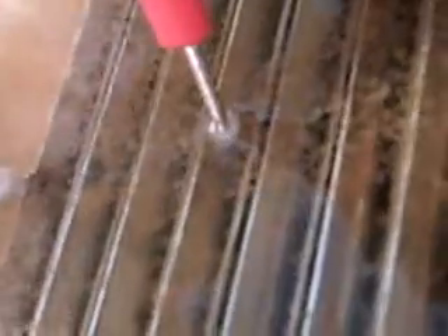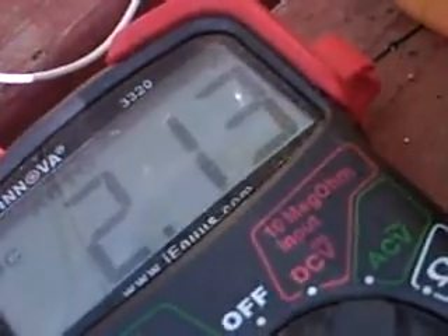Next I'll go to 36 volts. I'll start 3 slots over. Just by sticking the tip of the meter in you can see hydrogen coming off the tip. Starting at 3 slots: hitting 4 to 6 amps. I'll go 6 slots out to show the difference — that's 2.13 amps at 6 slots, and that's a lot of bubbles.